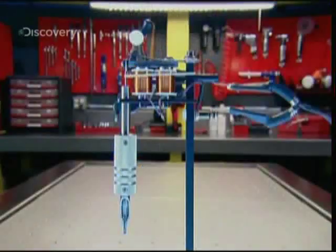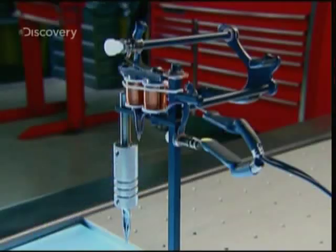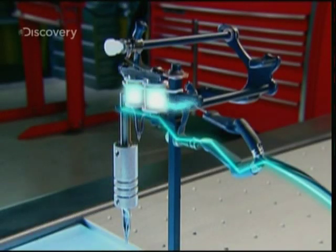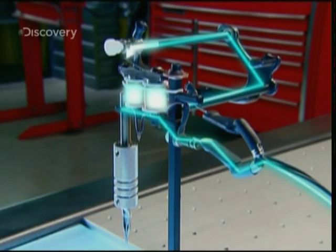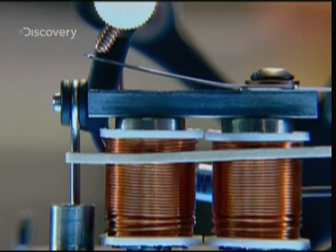1 hole. By pulling the armature bar down, the electromagnetic force breaks the connection between the contact screw and the metal strip. The result? Electricity stops circulating. No more electricity in the electromagnets means the coils instantly become ordinary coils again, no longer able to exert electromagnetic attraction force.